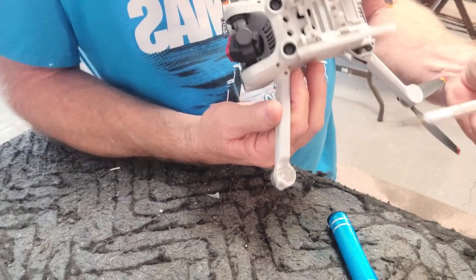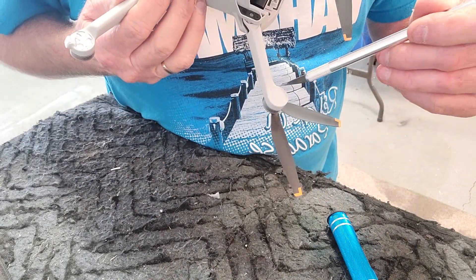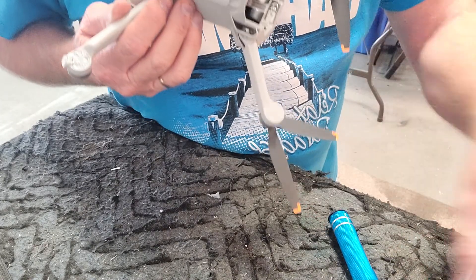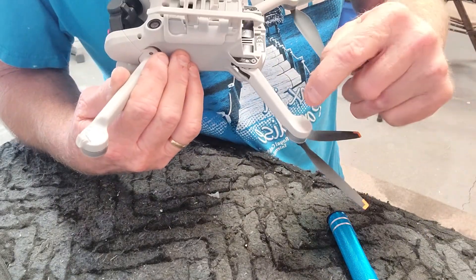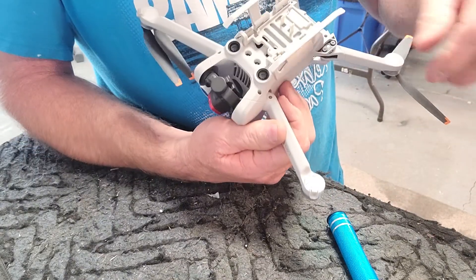You can get in here with a blade — I used one of these — and you can wedge it in and actually remove this cap. It's not reusable, at least mine wasn't. That will expose the three screws holding that motor in.